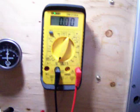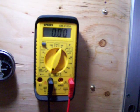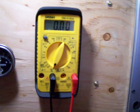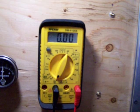That panel is hooked directly through my grid tie right now. It's only actually putting out seven watts right now — the sun's kind of going down. Right now I think the way it's configured I'm getting about 30 volts at one amp. If I run them parallel to each other I get about 13.5 volts at almost three amps.